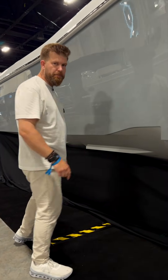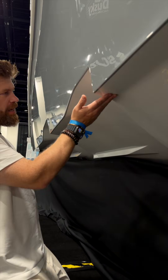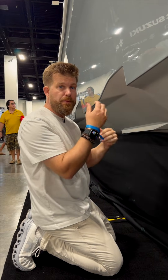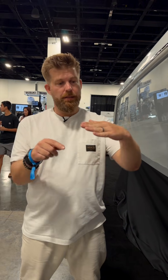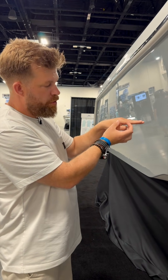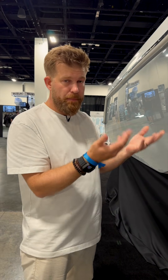We have these two shapes in the side profile of the hull — what do these do? Well, these are called steps. As the water is running down through here, you have air that is drawn down through this channel, and that releases air bubbles and reduces friction as you go. Jack, if you come up through here, you'll see the hull profile is stepped back a couple of inches, and then the chines start again. This is reducing the wetted surface of the boat. A deep V traditional planing hull's waterline as you're running would be further up here. The more steps you have, the more you're able to reduce that wetted surface further back through the transom, giving better fuel efficiency, more speed, and less drag.